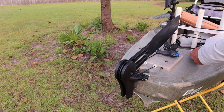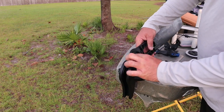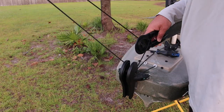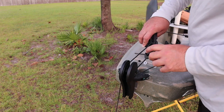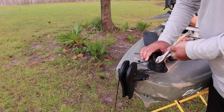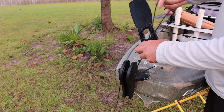Push it to the up position — you'll be able to see exactly where this little thing ties off. Line this up just like this; this knot should be down in this position. You'll be able to see that rope. Our goal is to simply remove this. You'll see those alignment tabs in there. You can see where this line comes over the top and this line comes out the bottom. You're going to take the cord that you loosened — the left side — pull it out from underneath that rope or that little bracket. Take your diagonal cutters because there'll be a lot of tension on this stuff from over time of use. Don't cut it — the goal is just to pull on it and get it to loosen up, and as it loosens up you'll be able to remove this.